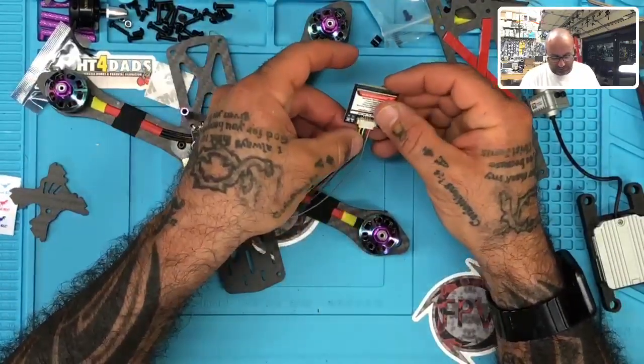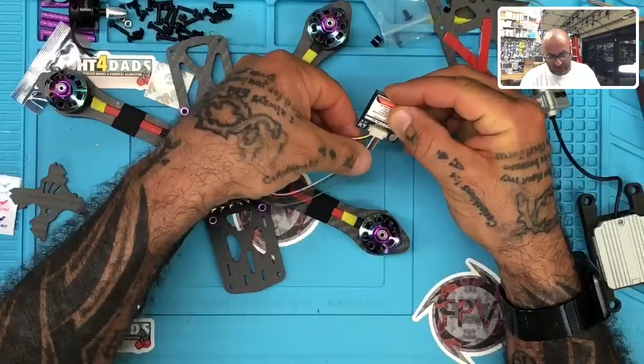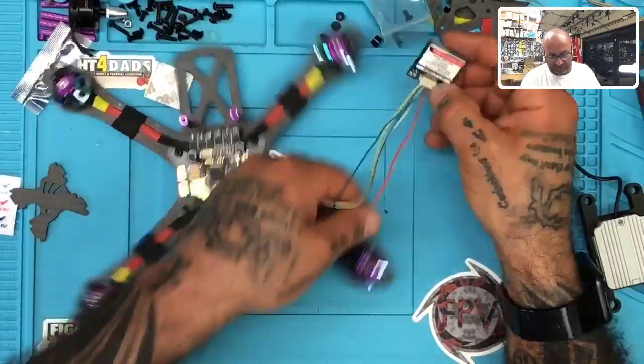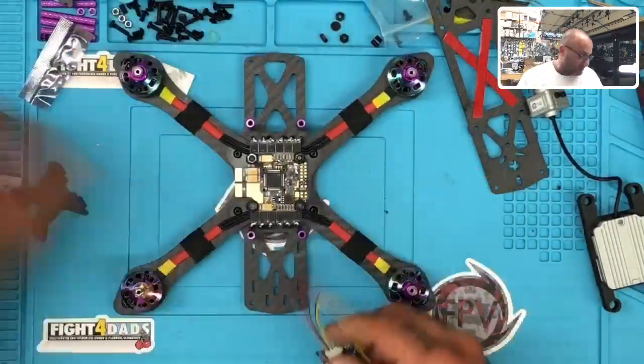All right. So we're going to do the following wiring diagram. We're going to go SDA, the ground, the TX, the RX, and we're going to reverse those, and then we've got the 5-volt and the SCL. Okay, so we're going to get started. And on this board, if you want to see the wiring diagram, which may help.